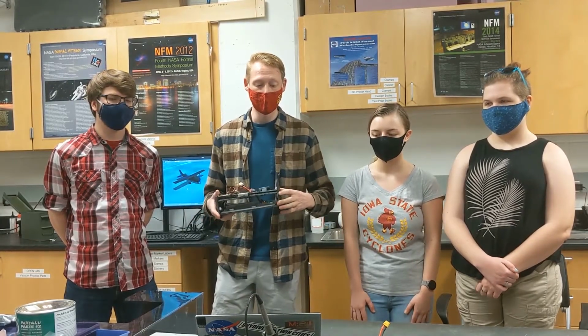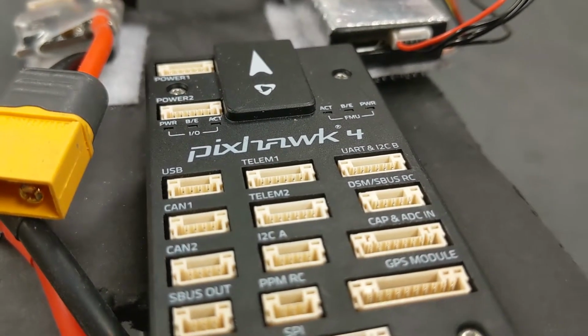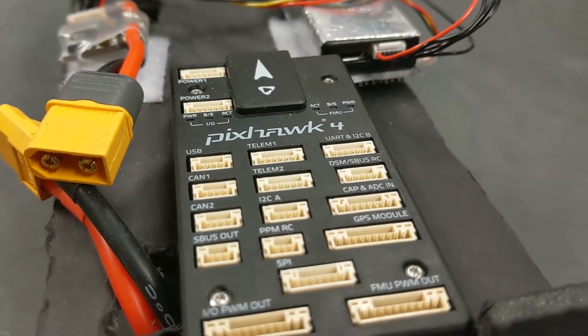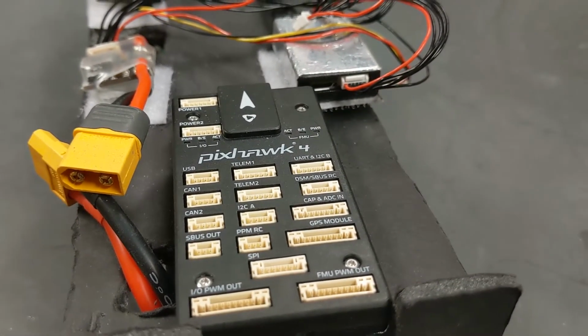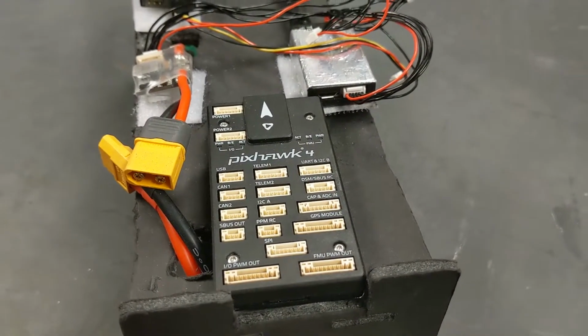The core of the Iron Bird includes the Pixhawk 4 flight controller. Pixhawk uses the PX4 flight stack, which is an open source flight software that is highly configurable, well documented, and already has many features already implemented, including flight logging and stabilized flight modes, which helps with flight testing. The Pixhawk also allows for direct interfacing with custom payloads like companion computers and FPGAs, such as the Raspberry Pi, allowing users to test flight software and other custom sensors. The Pixhawk communicates with the ground station on a laptop, allowing for flight monitoring and logging.